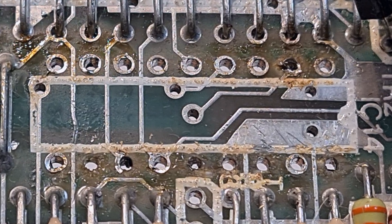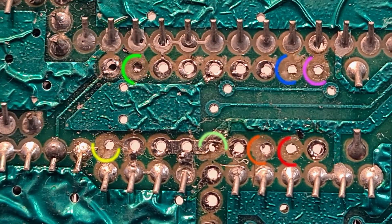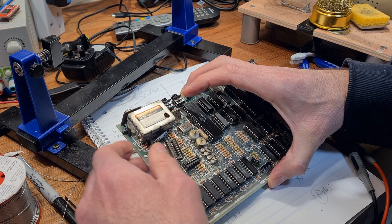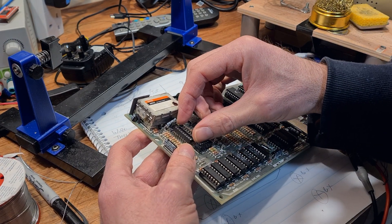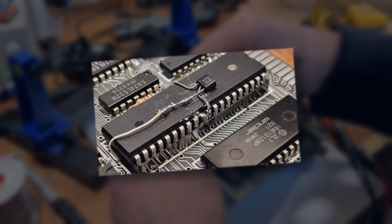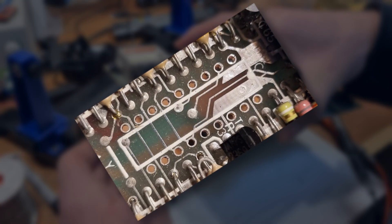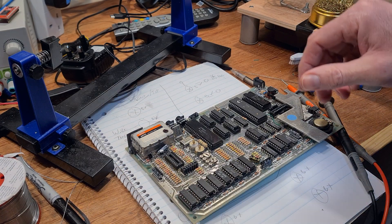And the bottom? 6 and a half missing pads. I don't want to keep ragging on the workmanship that resulted in this — I know everyone has to start somewhere — but a word of advice for anyone wanting to start out: if it looks like this, stop, get help, maybe even another hobby. For comparison I desoldered the same chip from another issue 2 board — here's a nice picture. Damage pads noted along with the ones not actually used.